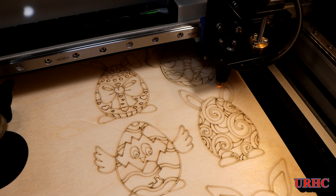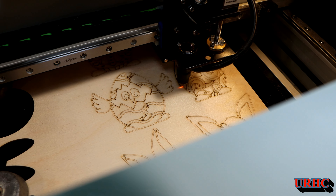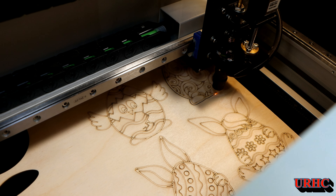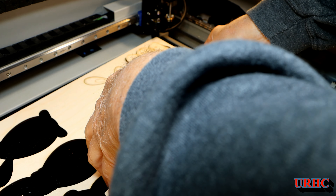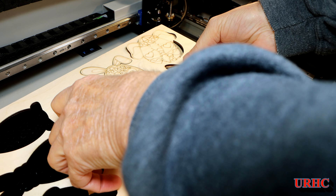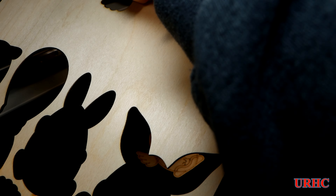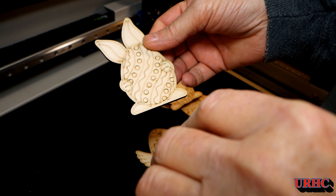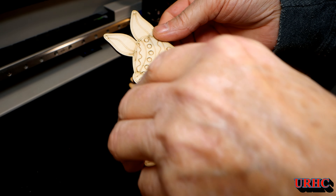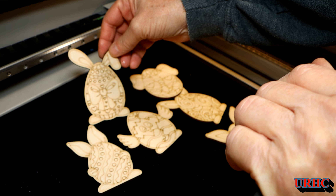Looks like it's a winner, so I'm going back on eBay to order more before everyone buys them up — usually what happens is I post a video and then they're gone. We're going through cutting them out, and pulling them apart you can see just how tight those kerfs are. The old ones used to fall right out, but now they're like perfect — a nice tight straight thin kerf. This really helped, and I think it will solve most of my problems. I'm going to look at the air assist next, but for now I'm just going to try it as-is. I'm getting nice light-brown cuts without a lot of smoke around the edges.